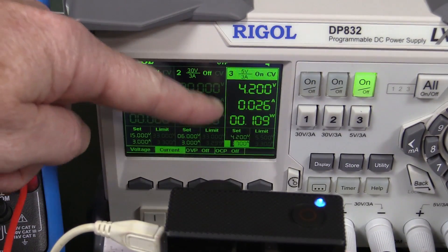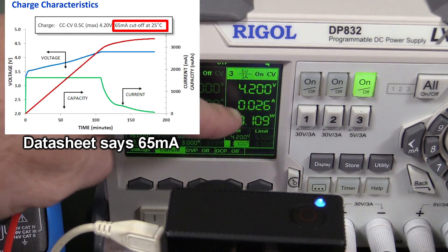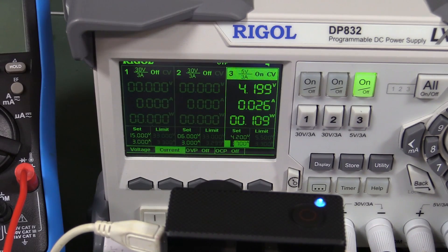Just over three and a quarter hours in - I stepped out and let it go a bit further than I wanted, but it doesn't matter. It's down to 26 milliamps now, and that's only about 1.5% of our original charge current - that's probably as low as you need to go. It's diminishing returns from this point; most of the energy has been put back into the cell, so leaving it longer is not going to help. Anything under that 10% mark - 5% maybe - would be a typical cutoff figure of that 1.7 amps we were charging at. So we'll call it quits.